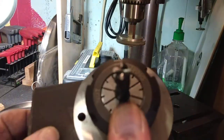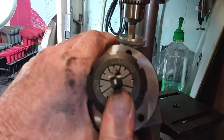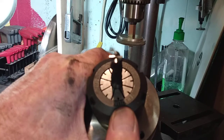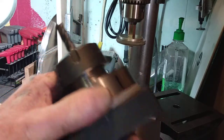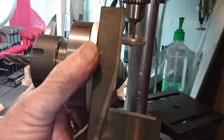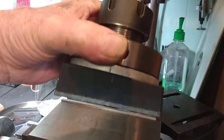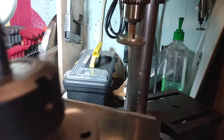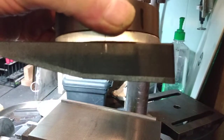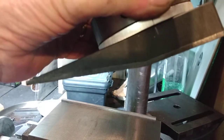Take that light away so you can see a little better. Come on, focus, focus, focus — focus for me. Anyway, oh, there we go. With this little jig made out of cast iron and steel, you can see you've got your angle for the flute, and you've got the leading edge sharpening angle and the back angle.